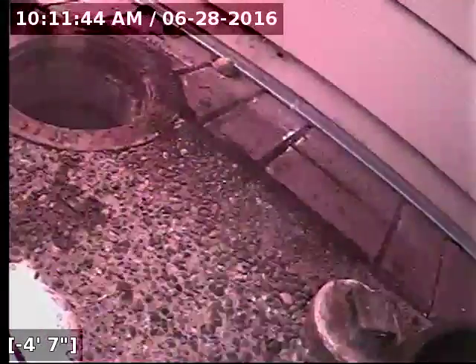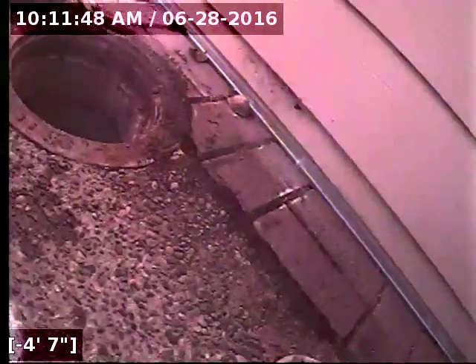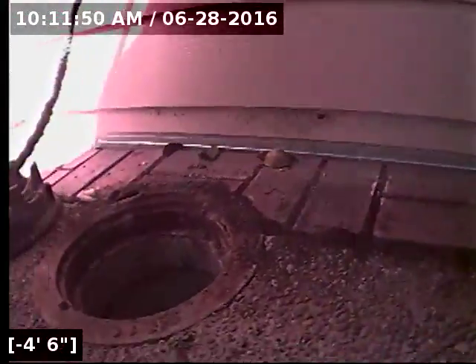The ABS and PVC portions are in good shape. The sewer line is functioning properly at this time to the terminus. But from that point out, it does not appear to be functioning properly. Get the HOA on it and I would recommend getting that cleaned out so there's no issues. And if it's something that happens consistently — and it looks like it is, because every outlet's having buildup — which is not generally a normal thing, you might have to put a schedule on this to do cleaning every so often so that it doesn't lead to an issue if you let it go too long.